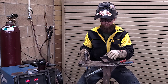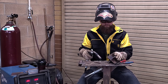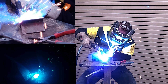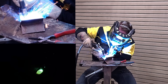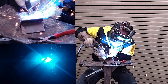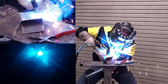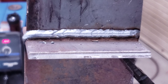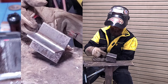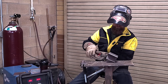It doesn't really matter at this point. If you were doing a horizontal one where it was propped up like a T, you always want to start at the bottom and stack up. But since we're doing this flat, you could go left or right. You can see we have our root one up there — that first pass we always call the root pass. We're going to cover that completely now and shoot the wire right through the gap between our first pass and our second pass.